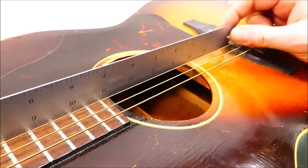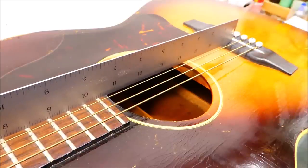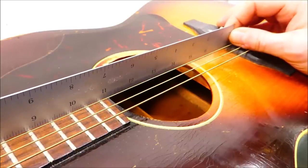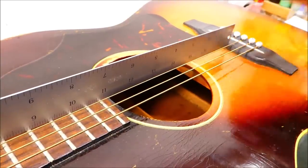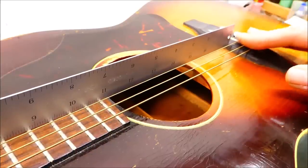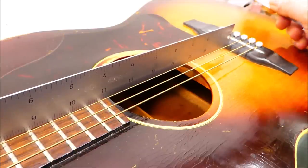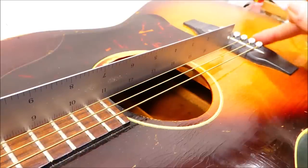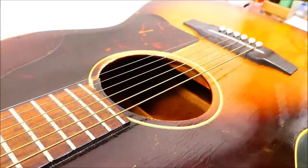In a lot of tutorials we're told that the neck should line up with the top of the bridge, and in many situations, yes, that's fine. But if we've got a more flexible top — and some ladder brace guitars tend to be more flexible — it can move down maybe a 32nd of an inch, 0.7 millimeters. If we don't account for it, we could lose a lot of saddle height trying to dial in the action. There are fancy dial indicator devices on the market that span the lower bout and measure what goes on back here behind the bridge, but this is pretty low-tech, easy, and repeatable, so that's the way I do it.